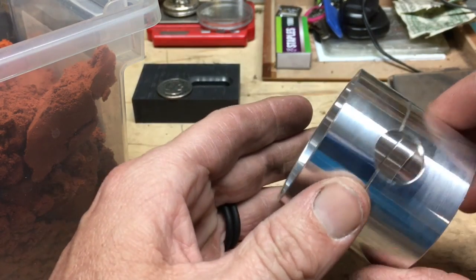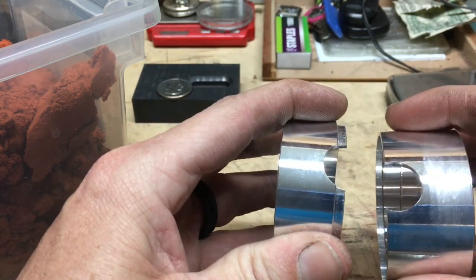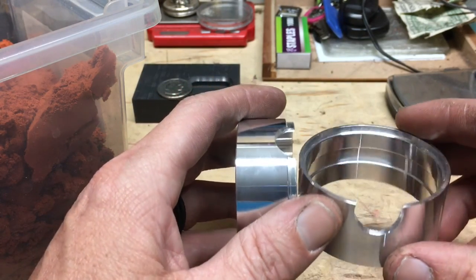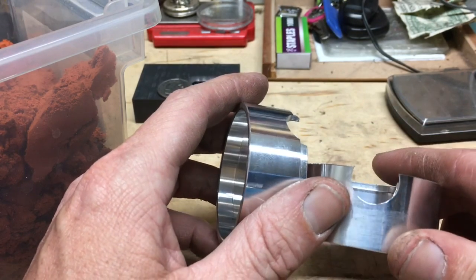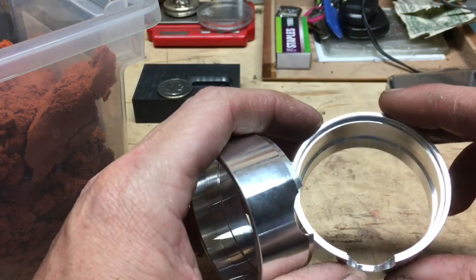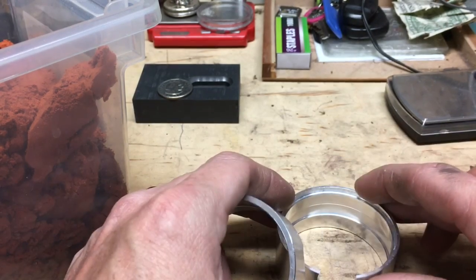So I'm going to go ahead and start, split this thing apart, and I'm assuming I use the big end to fill first. So I'm going to fill this up with Delft sand or Delft clay, pack it down super duper tight, press my coin, cut my pour hole. I'm going to get it all ready to go, and then I'll show you guys what it looks like before I get ready to pour. So hang tight. Appreciate your patience.